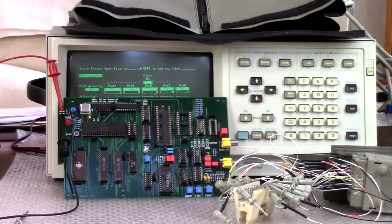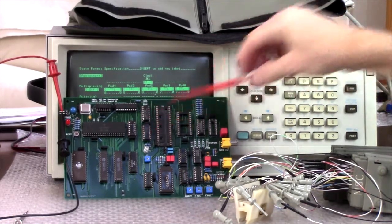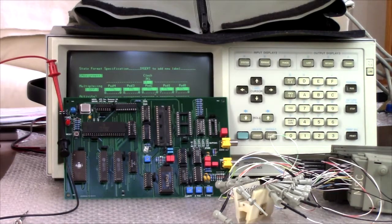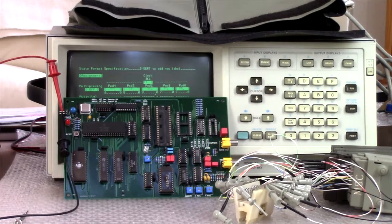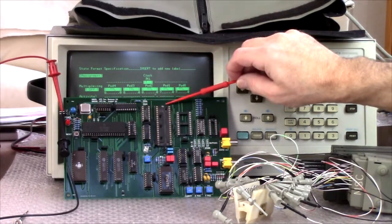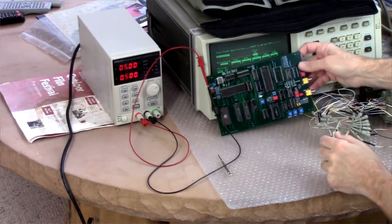Same thing with that, so you can't see it. It makes it a little harder if you're going back sometime later and troubleshooting. Or, if the socket happens to block your view of the part ID, just figuring out which one it is to plug the right chip into can be a problem. So, recommendation: always put your part IDs outside the parts, wherever possible.